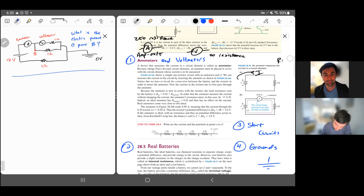For an ammeter, it's a bit more complicated, because you can't just connect it in parallel like this — this is going to mess up the circuit. If you have zero resistance, you're basically shorting it out. None of the current is going to want to go through the resistor; all of it will want to go through the ammeter wire, since six ohms is infinitely more resistance than the ammeter's near-zero resistance. You don't want to actually affect the circuit — you're just trying to measure it as it normally exists.